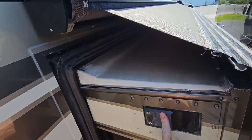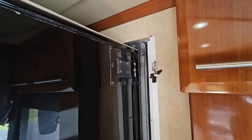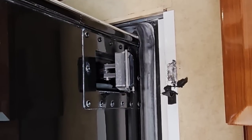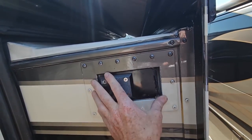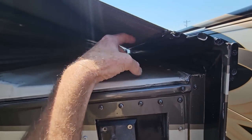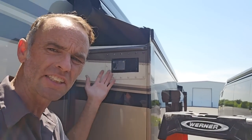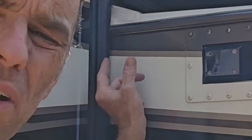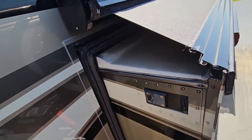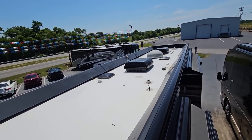Let's take a look at the roof of this slide out right here. This is a rubber membrane roof, but it does have a pitch on it, and all the sealant looks intact. It looked really good for 2008 — that's 15 years ago. One thing you might notice on this slide out is this weird-looking square block — these are the slide out locks, commonly used by Newmar until just a few years ago when they switched to a fully mechanical one incorporated into the roof. Their purpose isn't really a safety device; it's to keep the fascia in contact with the seal as it's driving down the road, especially in the rain. And while it is a membrane roof on the slide out roofs, it is a one-piece gel coat fiberglass roof on top.